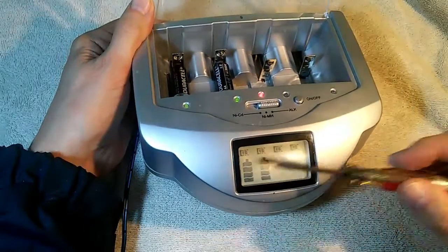One of the reasons I made this video was because the first time I tried this experiment I concluded basically the same thing — that these alkaline battery chargers really don't work because alkaline batteries are not really rechargeable. There's a reason why they call them non-rechargeable batteries. However, I got lots of feedback with people claiming that they recharge these all the time. So I thought I would put some numbers on this to make the point that these really are not rechargeable batteries. What little charge you're putting back into them really isn't worth the risk of damaging your equipment with leaking batteries. If you want to recharge nickel-cadmium or nickel-metal hydride batteries, that's fine — but alkaline batteries, nope.